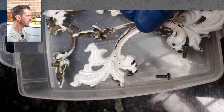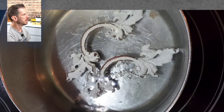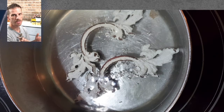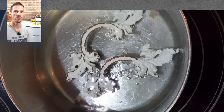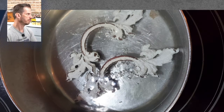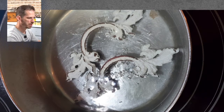This is a close-up of how thick that hardware is — it's already wearing off where my thumb's at. It's not really made for metal. Normally what I'll do — and you'll see two hardware pieces in here — is I set a timer for three minutes. I do half water, half vinegar, and I get the water to a boil. Then I set the hardware in there one at a time for three minutes. I wait for the three minutes, pull one out, and while I pull that one out I put the next one in. It takes me about three minutes to clean one while the other one's boiling. It's a nice process.